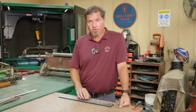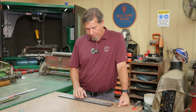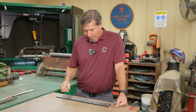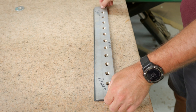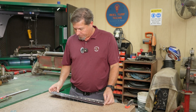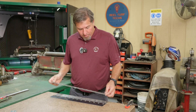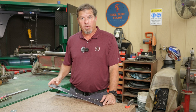I got three different Toro bed knives. The one on top is what Toro calls a short bed knife — it's a hardened bed knife made out of tool steel and it's the micro cut. Then the other one is just a standard bed knife, part number 93-430-62, which is the one I run on all my greens mowers. And then we have an extended bed knife, part number 108-4303.